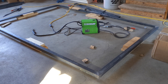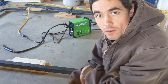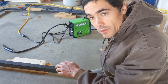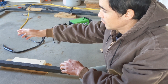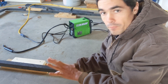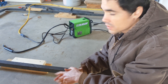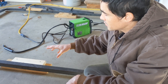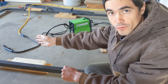Now that we've got the exterior frame of the trailer all set, it's time to start dealing with the cross pieces. There are two bars that I know exactly where they're going to go: one is going to be 16 inches from the front, the other one is about one foot seven inches from the back. The remaining bars — at least two of them — are going to be around the axle, so I need to get the axle positioned at 60% back from the front of the trailer.